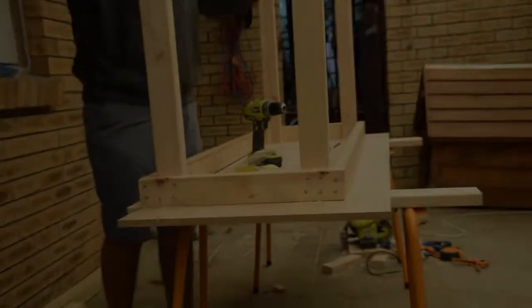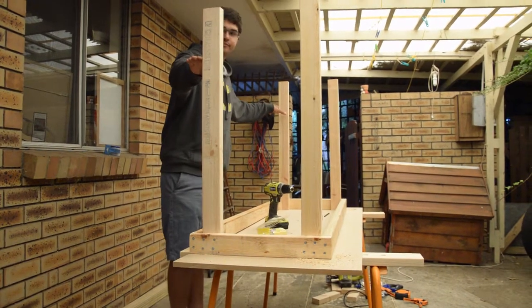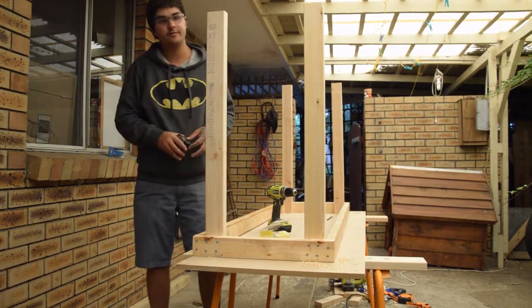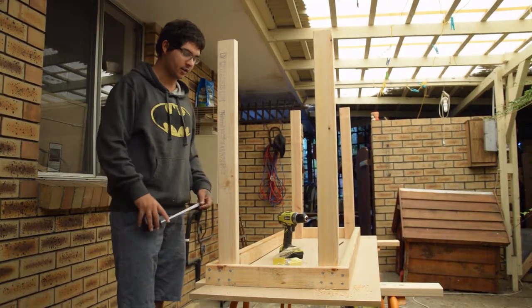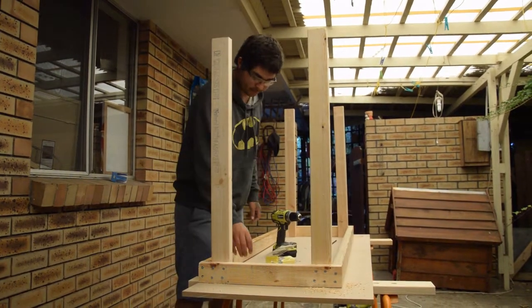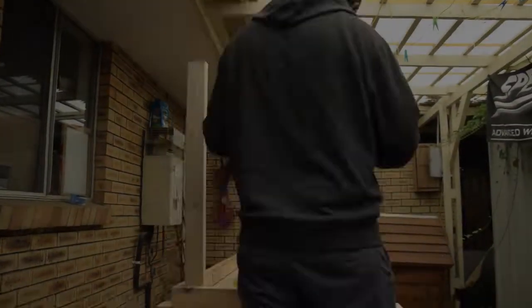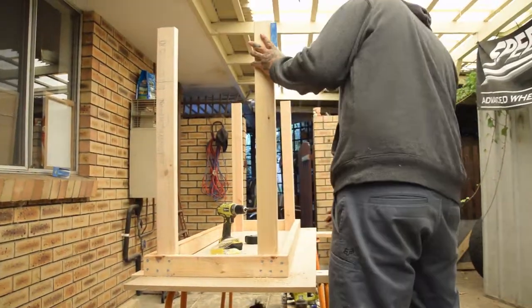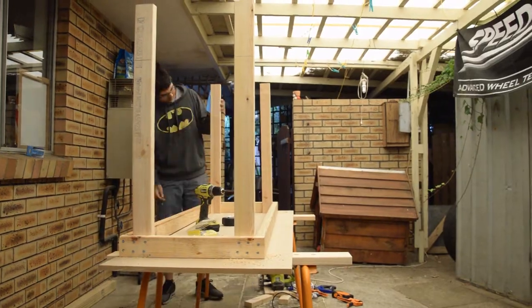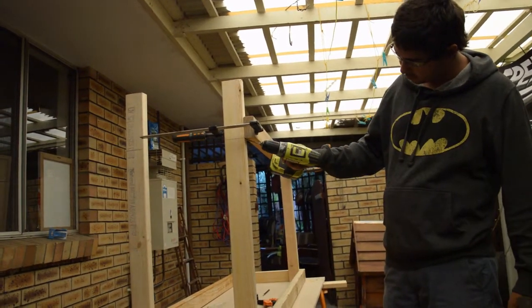Alright, that's where the legs are on. They're pretty sturdy. Now we're going to make them sturdier by putting the rest of the rails on about here. We're going to measure down about 200mm, mark the line, and then we're going to sit the rails there. We've clamped this rail into place and now we're going to drill in the screws. We've got it sitting on our 200mm mark.